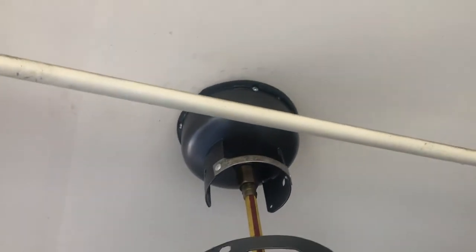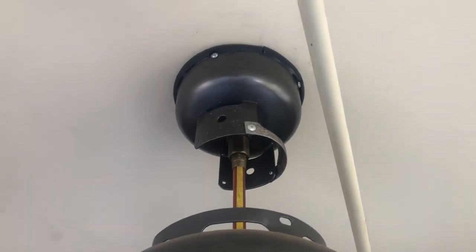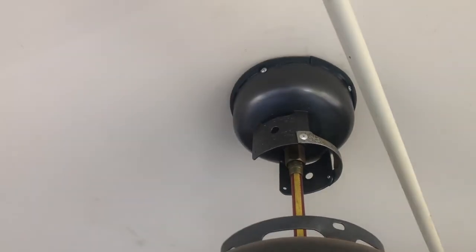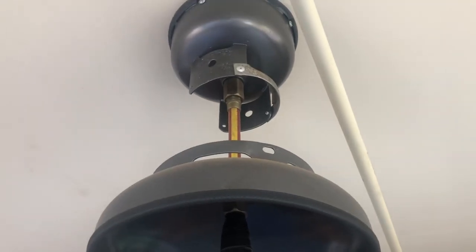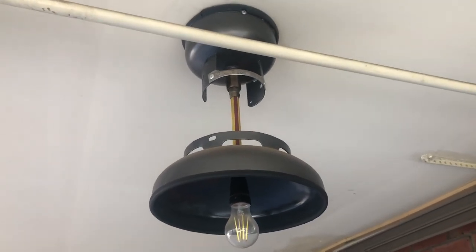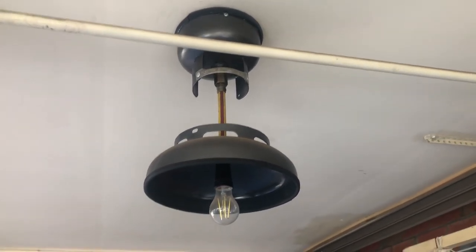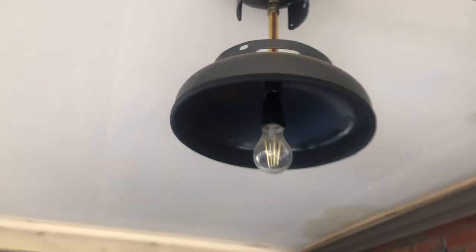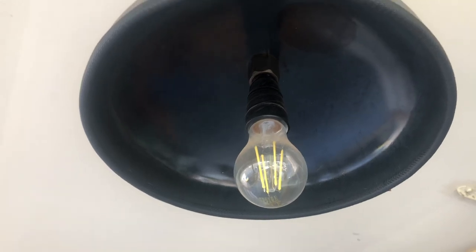And then we got that wooden block that's mounted to the ceiling, and then those screws in the side there, you can see that one, and then there's one around here. They screw into that wooden block that holds that up, and I've used a socket that connects into the old light fitting. I haven't used a junction to connect my wiring, but that is the alternative. I've painted mine metallic grey, Dennis's is black.